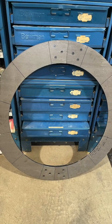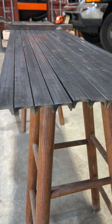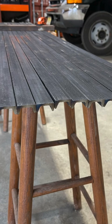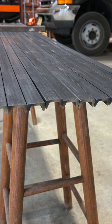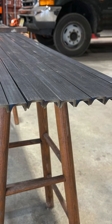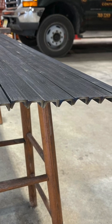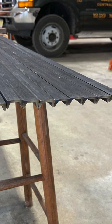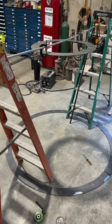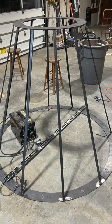These are the studs — there are 24 vertical studs all around the capsule. This was a mistake: I used this U-channel because I wanted to tap all of the screws into it, which is what I did. But I don't know — I didn't want to have two walls to drill through when using it, and it's not super structurally sound. Once you put all the shingles on it's fine, but moving it around with just the frame was super wobbly.